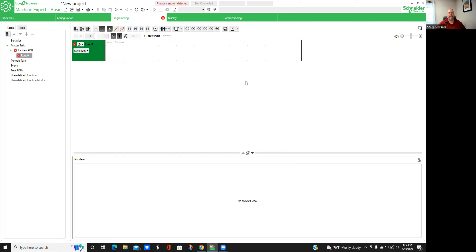What we're going to do is a basic start-stop-hold today, controlling a red and a green light. Just like in basic motor controls, we go through the basic steps and functions on how to wire a push button and a light. With the PLC controller, we have to understand how all that works before we can actually program it for what it's going to do. We're going to be adding inputs and outputs based on the function we want.